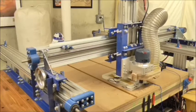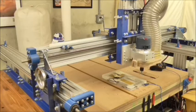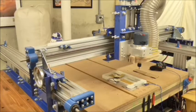All right, there's the touch. All right, now you can't see this, but there's a note to myself on my machine now that's telling me to swap out the pin with an 1/8-inch end mill, load my material, and then attach the dust collection skirt. Now, it's going to be a boring video if I have that dust collection skirt on, so I'm going to leave that off, but it's going to throw some extra dust around here.